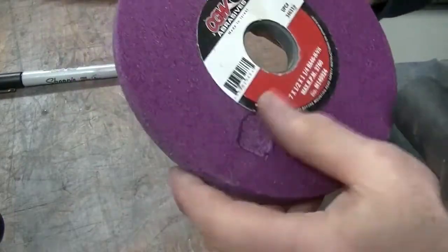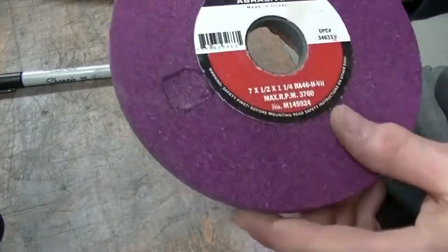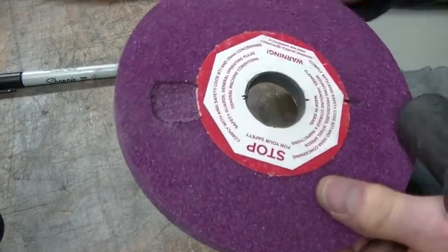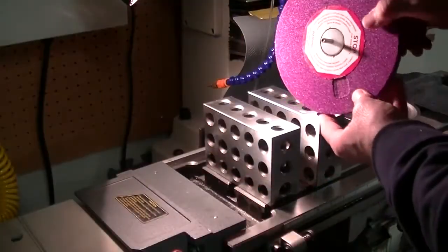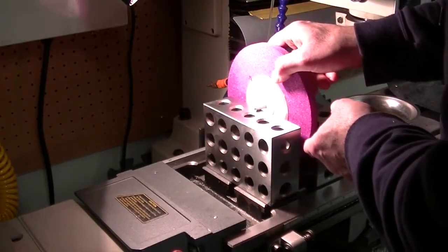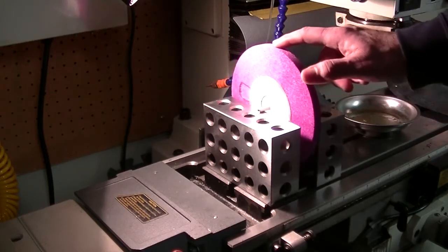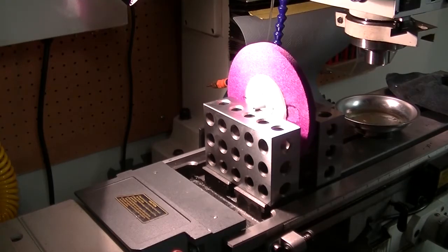On this side here that's roughly an eighth of an inch deep. I marked out the outline of how much material I've removed, and the same on the other side. Once you get to a certain depth the wheel is no longer useful, but that's a lot of material and I don't do a ton of surface grinding. So right here should be the light spot - I'm going to set it down and let go to see what happens. I still have material to remove, but it's better. Based on how slow it's dropping, we're not that far off, but still quite a bit of material to take off.